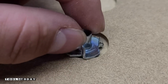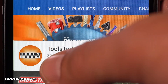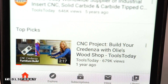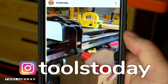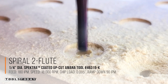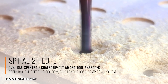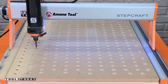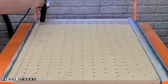You can see they fit in really nicely just underneath the lip there. I used the down cut action to leave a nice clean top surface. This is a quarter inch up cut bit and that will do a much better job clearing out the chips. The MDF likes to gum things up really bad, so that definitely helps clear everything out and get all of the holes nice and clean on what will be the top side.